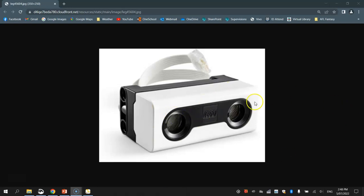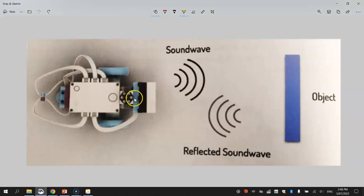The eyes are what you can see on your screen at the moment. They're sometimes called the distance sensor or the ultrasonic sensor. They work by sending out a really high frequency sound at about 40 kHz, which is beyond the human hearing range. That sound wave heads out, hits an object in front of the robot, reflects back like an echo, and the time taken for the round trip tells the robot how far away the object is.